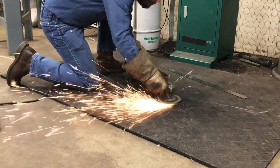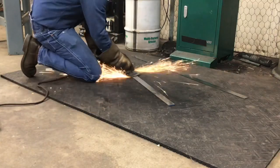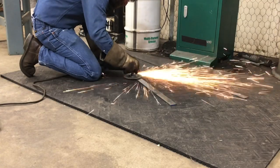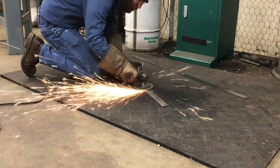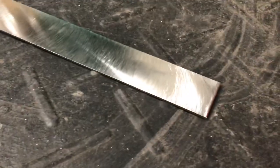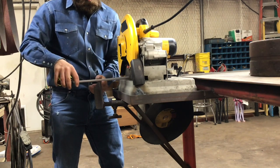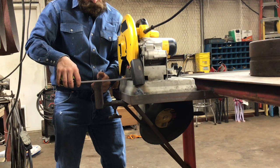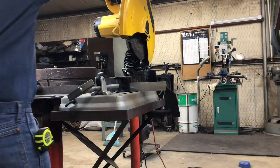I do this on the ground rather than put them in a vise. I'm used to always cleaning up steel on a rubber mat, but we'll do this — get all the mill scale off and then continue cleaning it up. You can see we've got them nice and shined up now. We're going to go over to the chop saw and set all these to the same length using the stop I've got built onto the end of my chop saw, and get them cut up and cleaned up a little more.